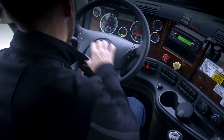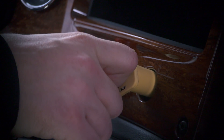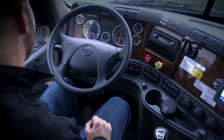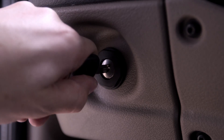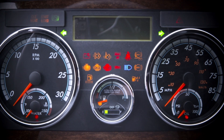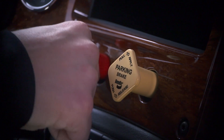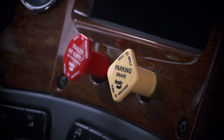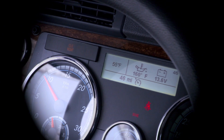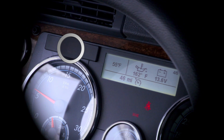When you're ready to get back on the road, turn off the cruise control switch and press the clutch or release the park brake to disable Optimized Idle. You can also choose to use the drive-away feature. If the engine is not running, start it, then release the parking brakes or put the transmission into gear. Let the engine return to base idle. The active idle management light will turn off, indicating that Optimized Idle is disabled.